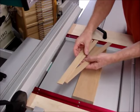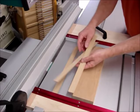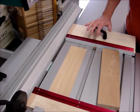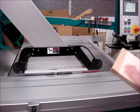So I've collected the short strips from my dust collection hood underneath the saw. These ended up being very consistent thickness — about 2.6 millimeters wide — and with a good quality rip blade it got a nice clean cut, very consistent, and I was able to do this very safely. So I'm really liking this Fritz and Franz jig. I'll leave some links for the plans in the description. I highly recommend the Fritz and Franz jig — thanks for watching.